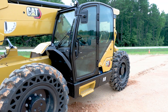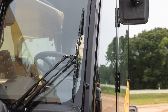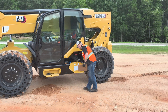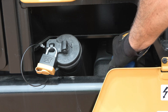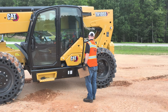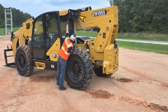At the cab, be sure to inspect the overall cab structure, ROPs, wipers, and wiper fluid levels. Next, in the compartment below the cab, you'll find the primary battery disconnect, batteries and ground wiring, DEF fill cap, and fuel cap. Behind the cab, you'll find the cabin air filter access and cabin heater air conditioner unit, if equipped.